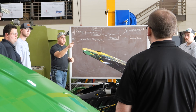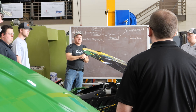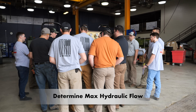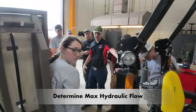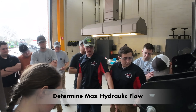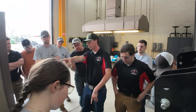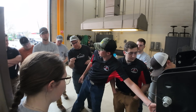You also saw the hydraulic kit on the back — that comes from summit-hydraulics.com. In ours, it's going to be running through the SCV. It's still going to be a true power beyond, even though you're running through the SCV — you're still using just straight off the pump. But we're really interested to see if there's going to be a pressure drop running through the SCV versus coming just straight out. So this setup bypasses the SCV over there, versus ours going through the SCV. But none of these are going to be in play — what dictates max flow is an open center.